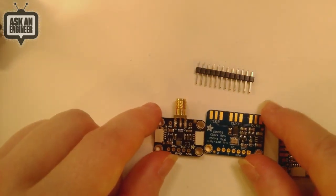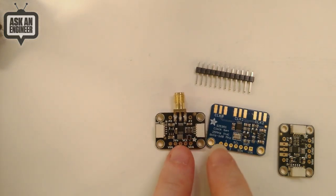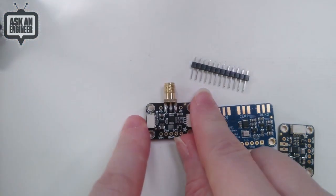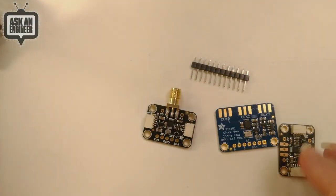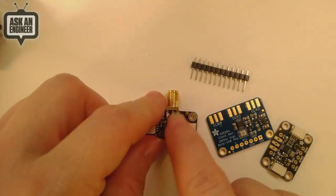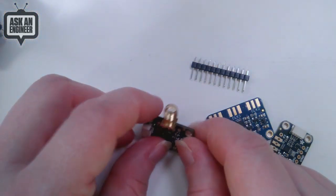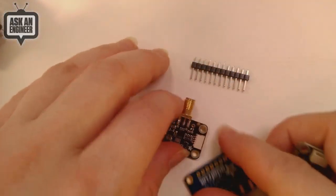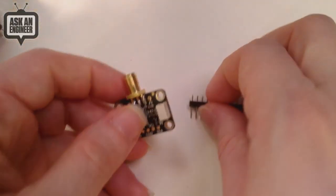So, there's two mechanical layouts. I think people have use for both. But for a lot of people, they really only need one output. So this is nice. Connect to I2C and you get your outputs here, three of them on a breadboard, or one of them with an edge launch connector. But both use the same code, both use the same crystals, chips, and everything.